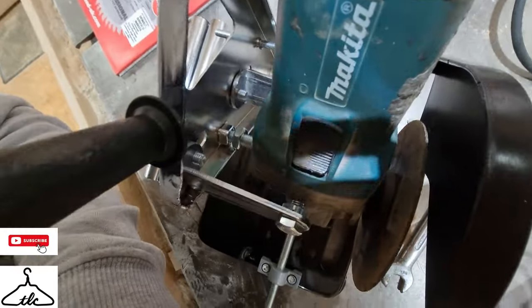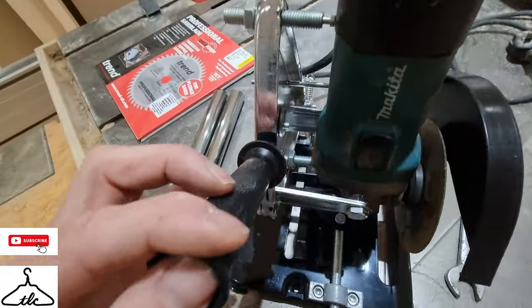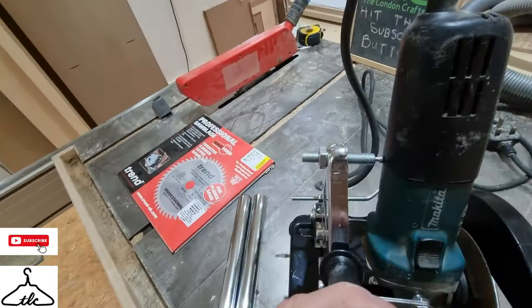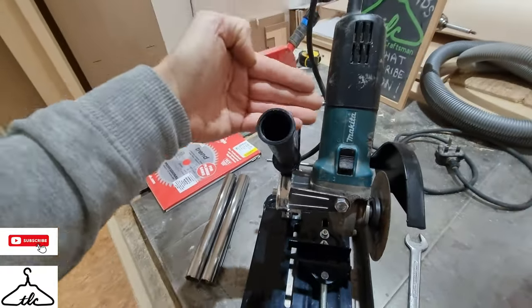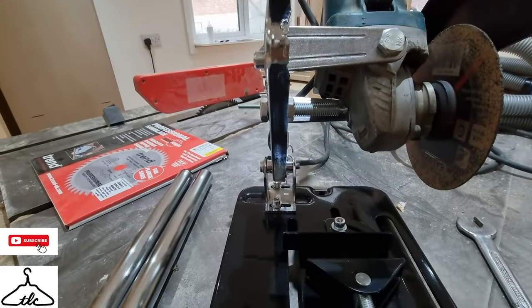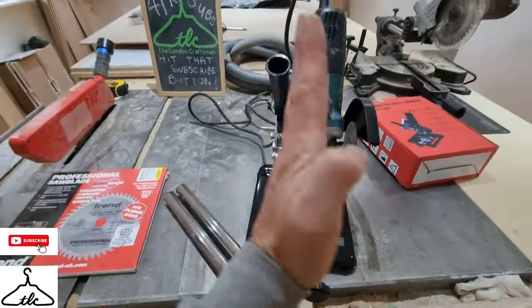It was a little bit floppy until I put the top bolt and bottom bolt in and really fixed it into position. To make it absolutely solid when I spring it down, I've used another nut on either side of the L bracket to nip that bolt into position. Then you've got these two bolts, top and bottom — they've got a little tab that just pushes up against the saw. You basically just nip them up and push the pressure towards that end of the saw, keep turning until it's pushing the grinder across. It pivots on this one and the reverse side, exactly the same brackets. Just to stop it pivoting, you push this one out and this one out until you've got it square.